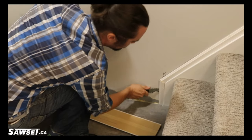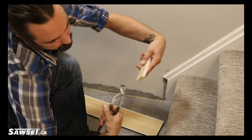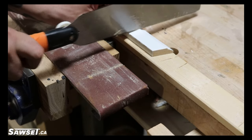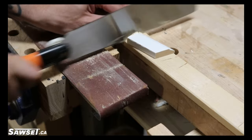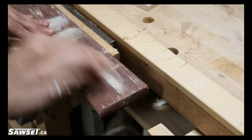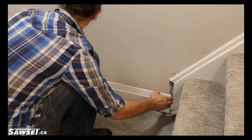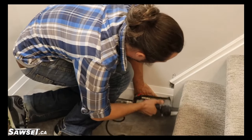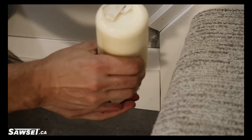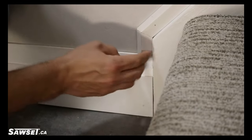I made a bit of a mistake here. I probably shouldn't have put this piece down so early — I should have put the baseboard in first and measured it on top of the baseboard. But hey, no one's perfect. That's what pliers are for. So I just popped the nail out. Now I have to take this piece of trim — it's only about 7-8 inches long. Ideally, you don't want to do a 7-8 inch piece on a miter saw; it can be a little dangerous and you get your fingers too close to the blade. So I'm using a Japanese saw here — these are really cool. Now that my mistake has been rectified, I'm putting the baseboard into place like I should have done to begin with. I'm just going to glue this tiny little piece because I'm using an 18 gauge and there's a good chance that might make it split. So a little bit of glue, pop it in, and just wait for it to dry and you'll be good to go.